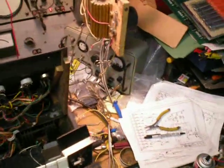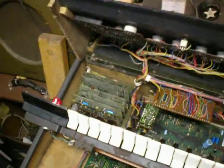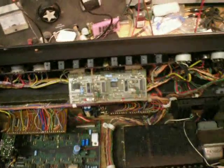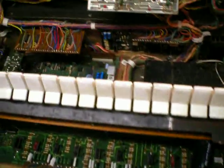We will explain how this synthesizer works. This is the original digital-controlled oscillator synth. I did a bunch of brushing up last week so I can explain everything about this thing. It has very crude — 1978 — just TTL and CMOS chips to do all of the functions in here. You've got your divide-down organ section down here in the DS2. The DS1 didn't have that, and it didn't have one of the LFOs.